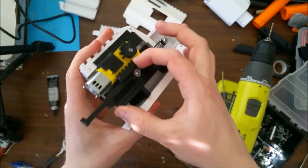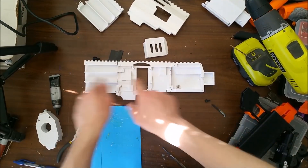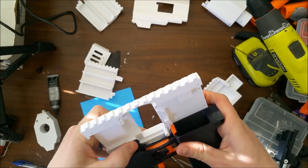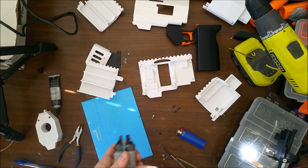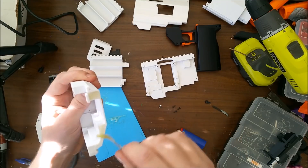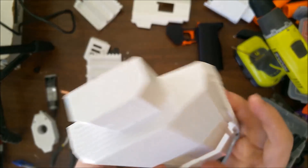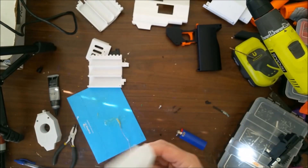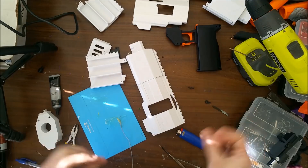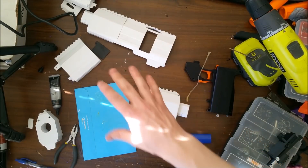This is the whole pusher assembly — gluing and screwing these parts together, as you can see they interlock with pieces that hang over. We pour out some Devcon. It's really important that the rails are all lined up very straight. We can set this down on a flat surface so both halves meet up perfectly symmetric and flat. We glued the middle right and the back right together.